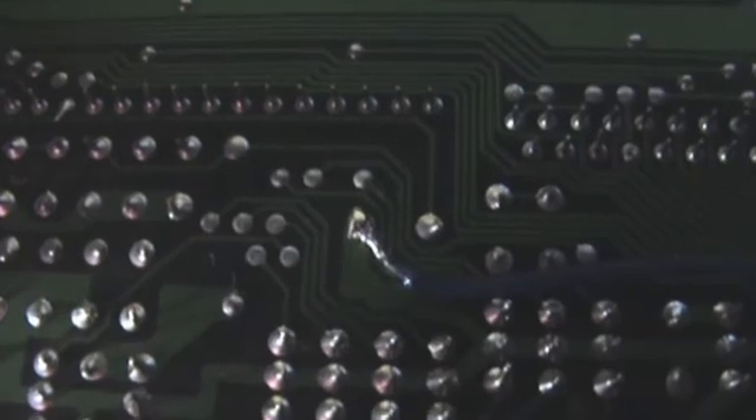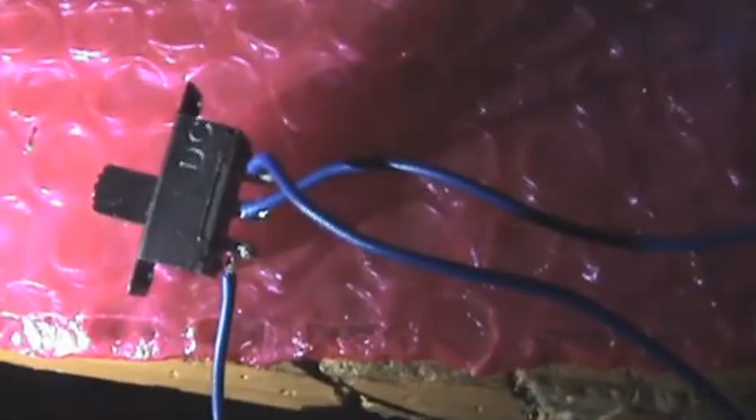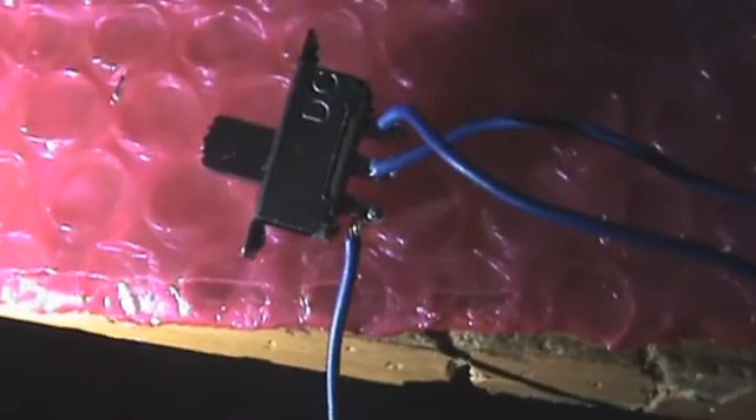So you want to just solder a wire to that. Now we'll have a look at how the switch is wired. The very closest pin is the one that comes from the underside, which is the ground wire. The middle wire is the one from the leg of the chip. So: closest one is ground, middle one is the leg of the chip, furthest one is the 5 volt — the one that's near the capacitor but isn't the leg of the capacitor. The second one that we did is furthest away, middle is the chip, and the closest to us is the underside.